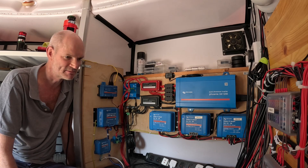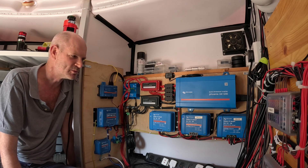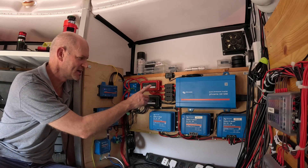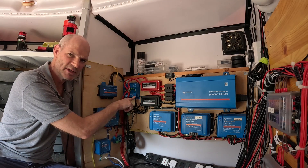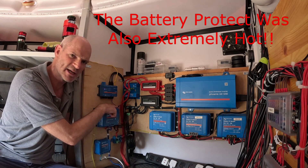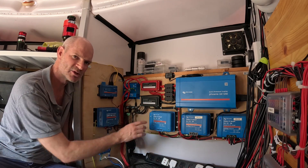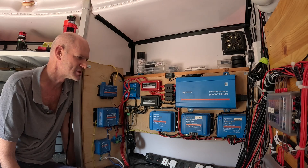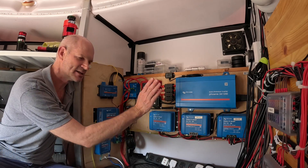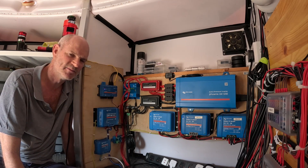The system is fully charged and kept topped up while I'm away, so there's no issue there - I couldn't understand what was going on. Checking the system on the app, I could see on the downstream side of the smart battery protect there was about a two or three volt drop compared to the upstream side straight off the battery. The batteries were sitting around 28 volts and I was seeing around 25 volts downstream, and when I powered up the mini PCs it sucked the system down - the inverter tripped out and the BMS dropped out on under voltage.